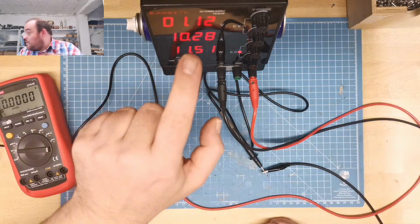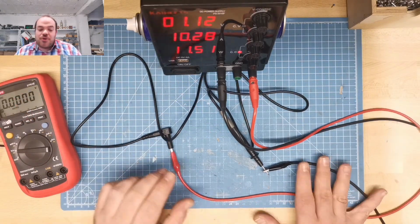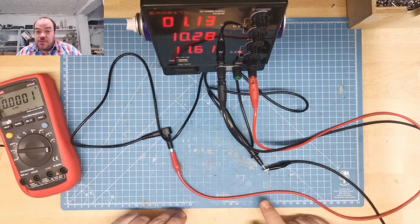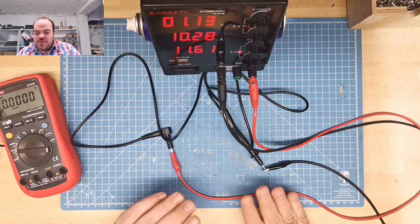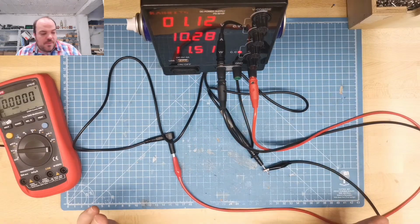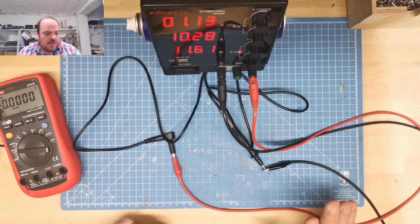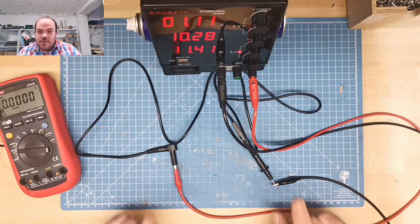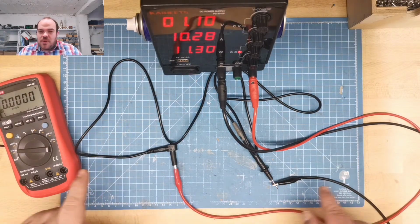And we can also use this measurement. It says 11 watt. That's a lot, but I'm not sure if it's going over my cables or is something internal resistance from the shunt that is measuring. The only thing I can say at the moment, it says we have 10 amp. Maybe I should just trust this 10 amp. What I want to know is how much of this 1 volt shown here really drops over the cable.